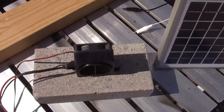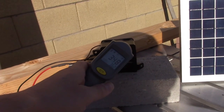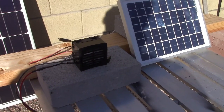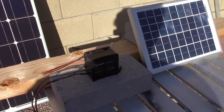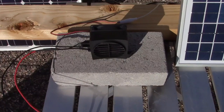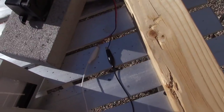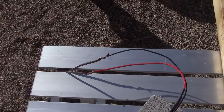If you want, you can just put them all to the same panel, but just for clarity I'm using two panels. Check those temps out — up to 362°F. It's a 100-watt, 12-volt unit, so you can put it straight to a solar panel. It's got a little fan attached on the back and it just cranks out the heat. Now let's put the fan back on — the fan hooks up to the 5-watt panel and the heater part to the 100-watt.